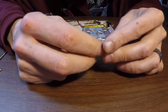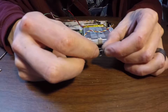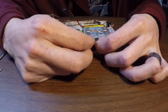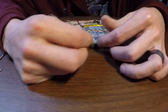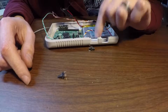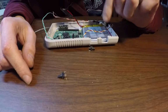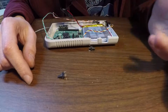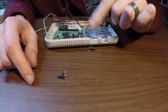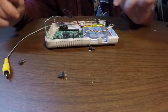Before I do that, though, I'm going to clip the pins, because I don't need all 4. I think it's 1 on each side. I just need 1 side. So I'm going to clip those real quick, glue these together, and just kind of tack glue them in here for now, and just kind of see. Before I glue them in there, I'm going to wire them. But I'm either going to make these the shoulder buttons, left and right, or L1 and R1, or R2 and L2, whatever. Or I'm going to make that the X and Y buttons so I don't have to drill into the shell. I think I'm going to make these the shoulder buttons, though, is what I'm going to do.